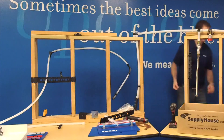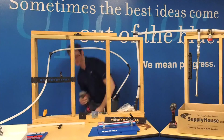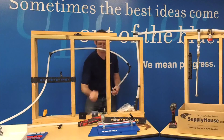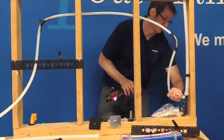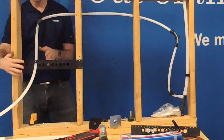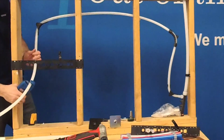I need some half-inch rings to make this possible. To make these connections I'm going to take this expansion head that I was using for three-quarter inch off, and put a half-inch expansion head on the tool. Then I'll take a half-inch ring, throw it onto the pipe, and simply connect it to my multi-port T. I'm at the part where I can come out of the wall. I'll cut this pipe just a little bit long so I can get it into the bend support. After I'm done making these connections, I'll put a cap on and then pressure test the system.